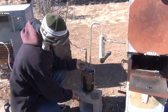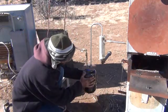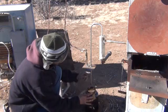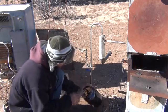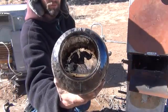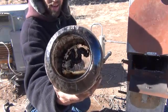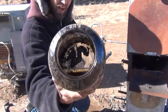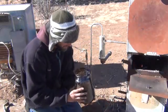Let's go ahead now and see if we've produced any fuel inside our condensation jar, our condenser. This is a little difficult to get out from underneath here. Let's remove our jar. You can see what's inside the jar — this piece of pipe here. Now it smells like fuel, that's a good sign. Let me show you what it looks like inside of there. Some of the black you see at the bottom was just some leftover biocrude in the jar that's now been stripped off the sides by the fuel condensing. You'll see a couple of layers of fuel inside — one a little bit darker than the other, one floating on top of the other, and then a third one at the very bottom. The middle layer is diesel.